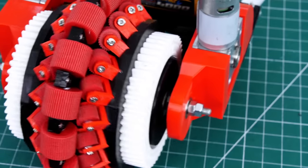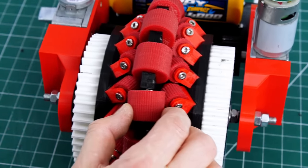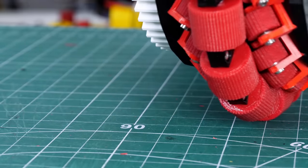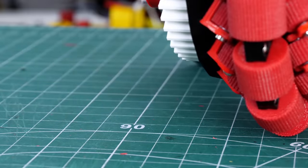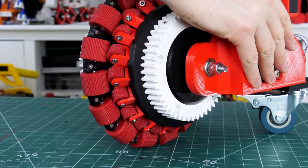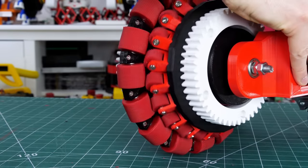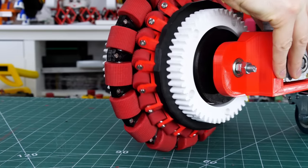You can see quite clearly that the little wheels around the circumference of the Omni wheel are turning as those slanted rollers rub against them on the two active hubs — so that's pretty good. It's only relying on friction though, so I can actually stop them with my hands. If I grab one and drive it you can see that they just slip past. The one on the bottom though has got mass pushing it up, so that seems to do a lot better purely because the weight of the whole robot is on it, helping give friction with the other rollers. At the bottom the rollers are still partially working although they're still slipping a bit — sometimes against the surface and sometimes against the active rollers — but altogether it's applying quite a bit of torque.